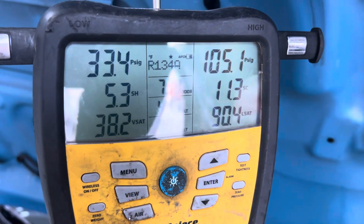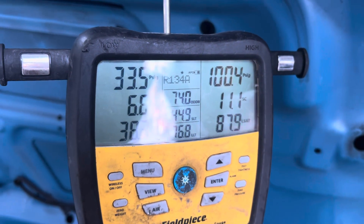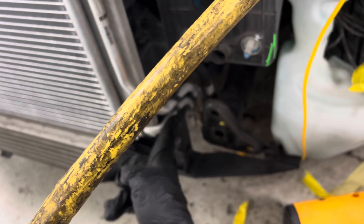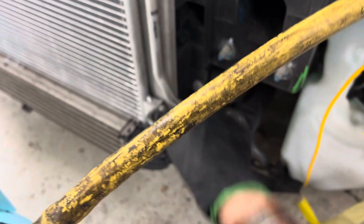Let's just look at superheat and subcooling — let's see the temperatures. Let's see what our discharge compressor temperature is. Right now our liquid line is 75 degrees. Our ambient air temperature looks to be about 60, going to be 65 degrees once that drops. This small line right here is 72 degrees — this is coming from the compressor feeding in. Let's see what our discharge temperature is, about 105 or so.